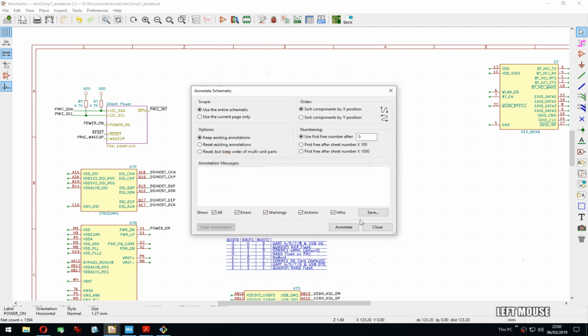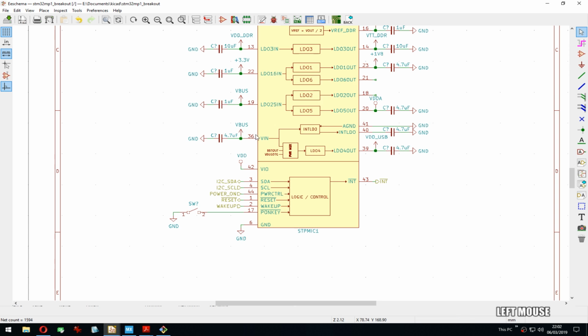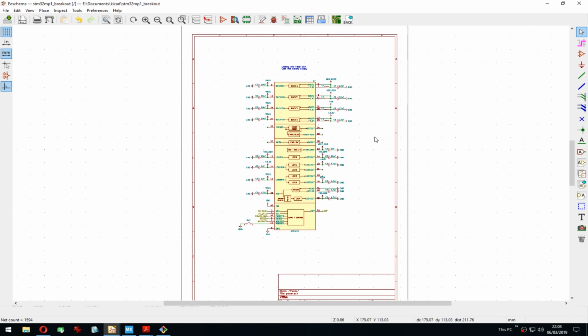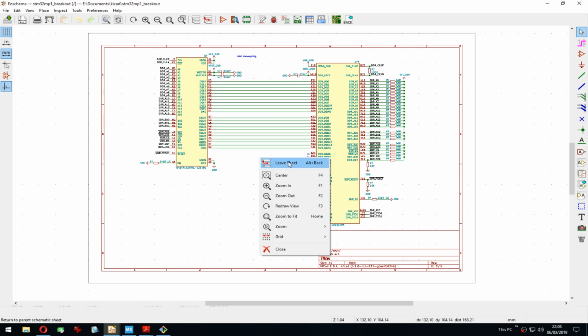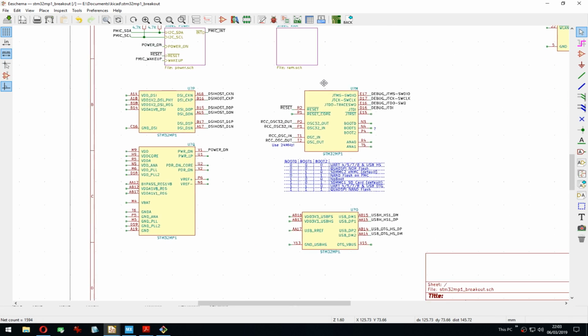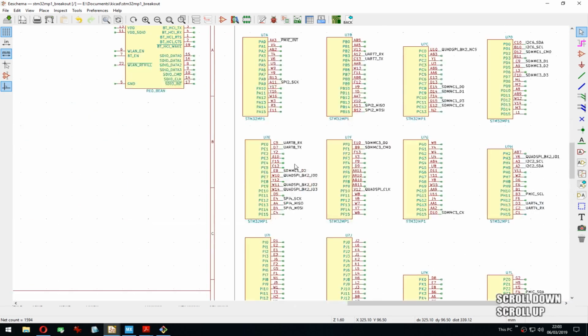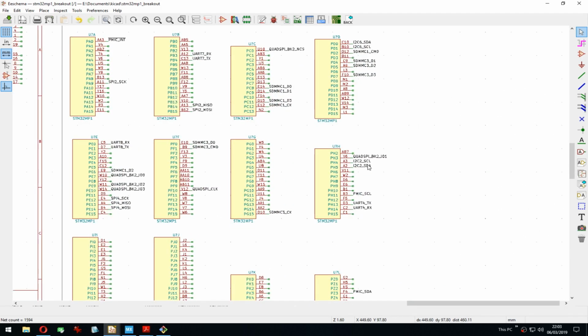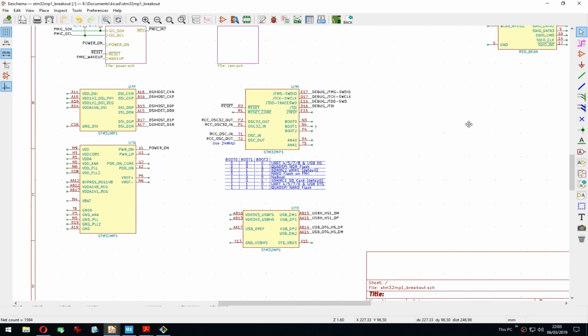So that's where we are now. This got a lot cleaner when I moved these huge chunks away. Like the LDO is here. We need to work on that one. RAM needs decoupling, but that's quite alright. I think we're getting somewhere. Yeah, next time, well, we have a lot left. Like we have to do the SD cards, we have to do the DSI, the USB, 2 USBs actually. Need to figure out the power, the VBAT stuff.